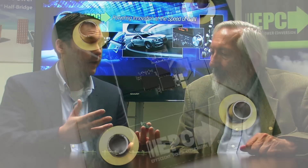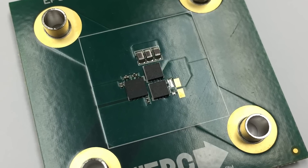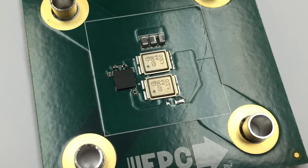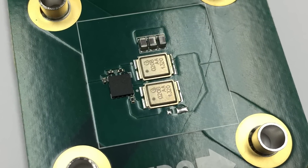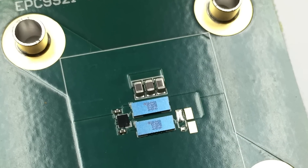What we have here for show and tell is essentially some standard MOSFET technology — this is an SO8 or LF pack — which is what MOSFETs have been using in various forms for a variety of years. As the push for power density, better electrical and thermal performance has continued, MOSFETs have tried to improve their packaging, including double-sided cooling MOSFET packages. And then we have eGaN FETs. As you can see, they are very small and have a much lower on-resistance, which has to do with the advantages of gallium nitride.